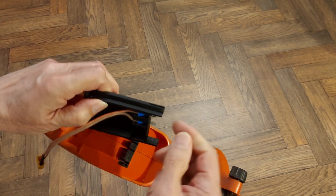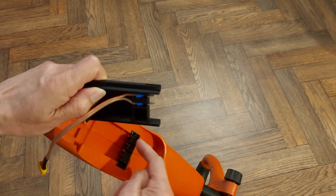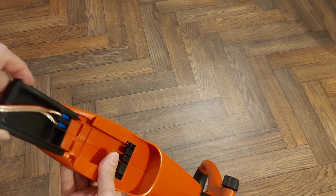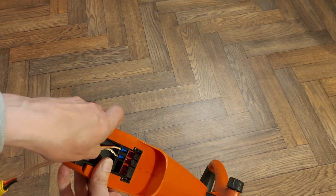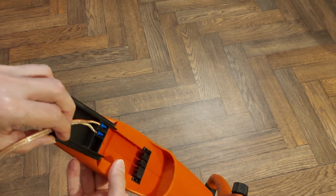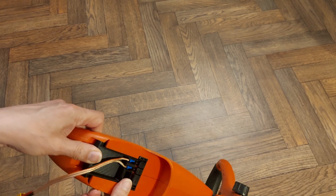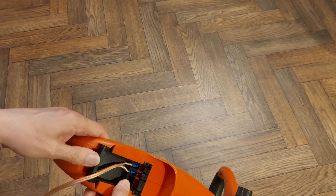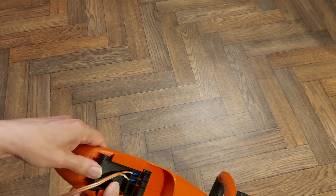If I hadn't actually copied the original model and didn't bother about these bits going forwards — just left those bits off — then the springs wouldn't be pushing against them, which is another option. Because if I keep it this way, I need to replicate the ratchet effect or the lock that goes just there — the hook that goes into that slot. I'm very tempted to do away with that bit so we don't have the spring, so it'll just stay in place without the lock. I'll think about that — or I could do a simple lock, something that just springs in place with a lever to remove it.